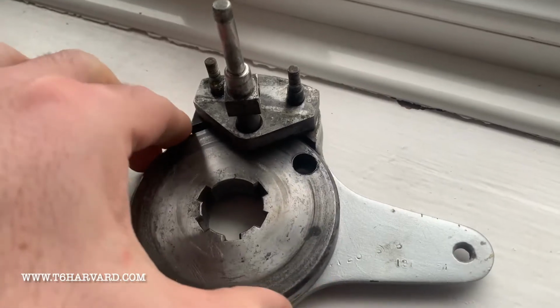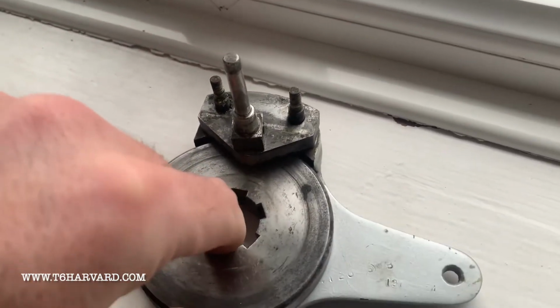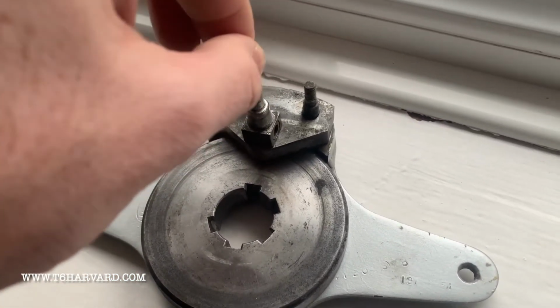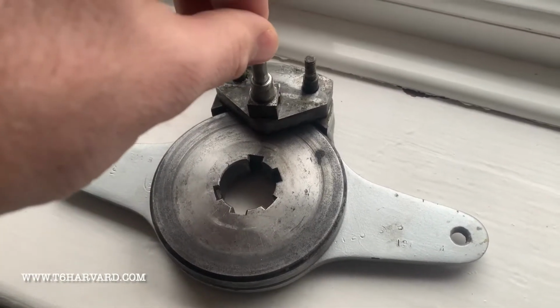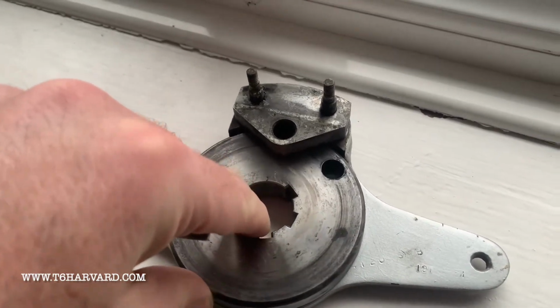And if you imagine you're turning fairly sharply and you're about to drop in, there's a lot of force running through that pin to give you a side loading. That's what causes the wear, and it can also cause the pin to shear entirely. And a sheared pin's no good, because then you've got a fully castoring tail wheel, which will make landing quite interesting.